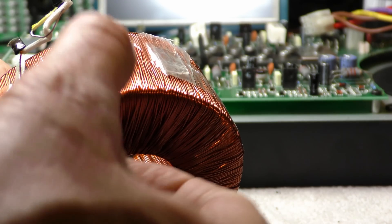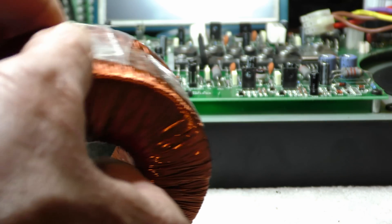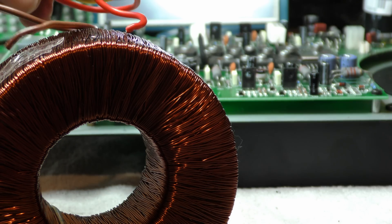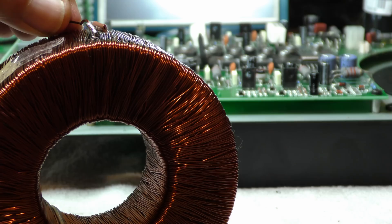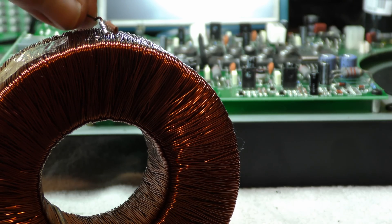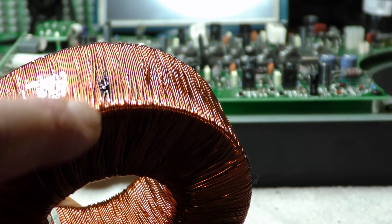By the time you add the tape and then all the secondary windings, it squeezes those into the primary — and so that's already damaged, which probably would have caused it to fail in the future. Around this side, you can see all the secondary winding connections. Where these have been pressed into the transformer, it's damaged the primary and eventually started arcing and blown the fuse.